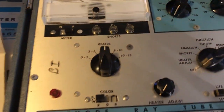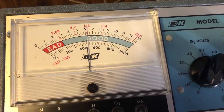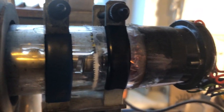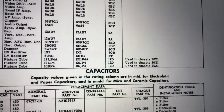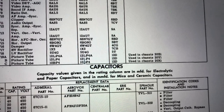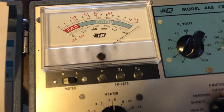It's a 12LP4, so we're going to put it to 6.3 volts and let it sit for a second. This set had three different options for the picture tube depending on the chassis model — this is a 20Y1 chassis with the 12LP4. It's cool that they had a 10VP4 version of this set too; I like the smaller picture tubes. Let's check for shorts — nope, none.